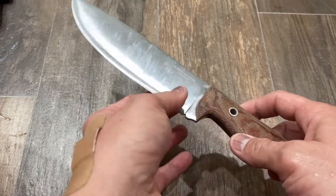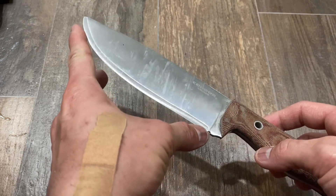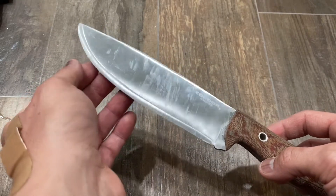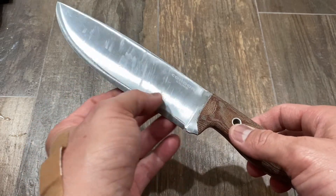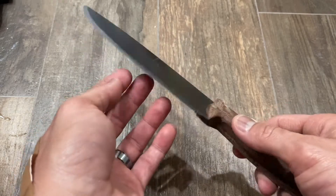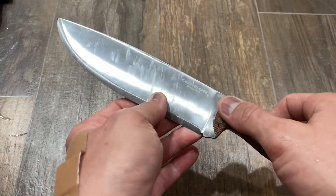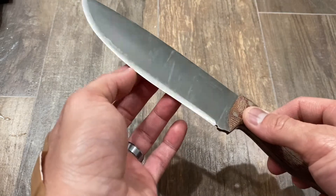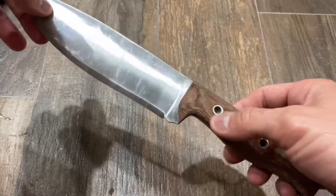The materials: the steel is 1075. We focused on the performance and results of testing, and the hardness. 1075 has gained respect from me. Prior to my recent Condor knives, I had not tested 1075 — I had tested 1095, which is a well-loved blade and tool steel that can rust on you. Apparently this can rust as well, but what has surprised me is the toughness. Really, really tough — absolutely no edge damage after all that work.